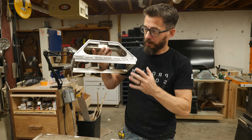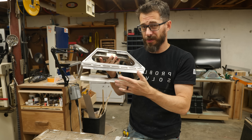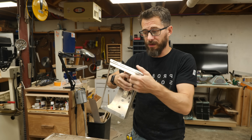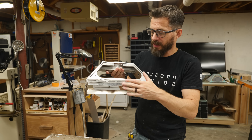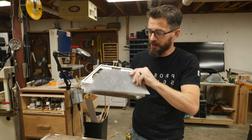After a whole lot of welding, I'm at this point, and it's not completely done. There's a lot of gaps here, but a lot of those gaps will actually be filled with body filler. I'm going to use some Bondo-type material to fill in these spaces that are not structural. It is welded together, so it's nice and strong, and I don't have to fill in every little piece with aluminum. We're going to do that later on.